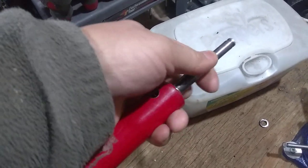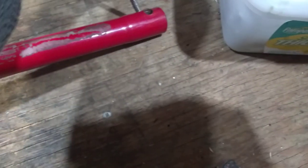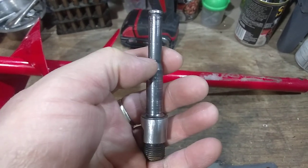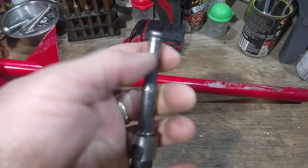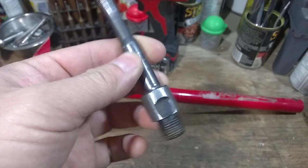My one already fits. I'm going to cut it. All you need to do is drill a hole here in whatever size matches the shaft — go inside here and you're good to go. For this part, you need to cut it because my one is a half-inch drill, so I need the thicker part. Or you can use the thinner one — up to you. Just use a hacksaw or a grinder to cut it from here and you're good to go.